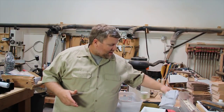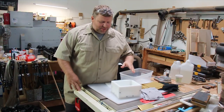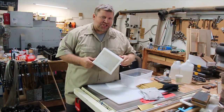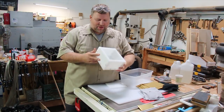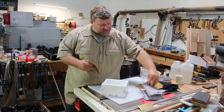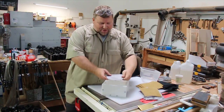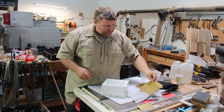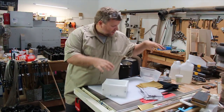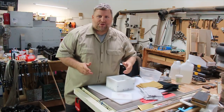I cut up an old t-shirt, so I've got two colors of burlap and a t-shirt. The way I'm planning to do it is very simple - I'm going to basically cast in this large HDPE mold from P-town Subbie. I'll put a link below if you're looking for a big block mold like this. I'm going to take my burlap and my shirt, which I guess is just cotton, and layer it into the mold. I already cut these to the approximate size of the mold. Then I've got another piece of HDPE that I'm going to put on top, drop it on, and clamp it down to put pressure on it and force out the air.